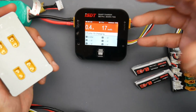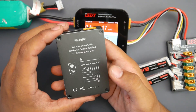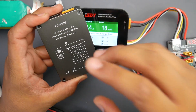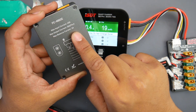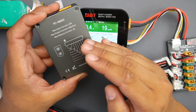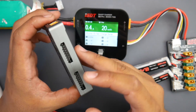If you're in the FPV market or flying little drones, there's no way you'd even get close to what this thing is rated for. If you're charging through just the balance ports, you can do that, but the maximum current is 2 amps — keep that in mind. There's no fuse on that circuit, but I think what could happen is you could burn a trace on the PCB, which acts like a fuse.